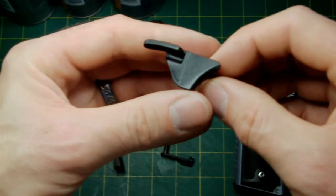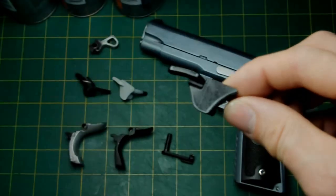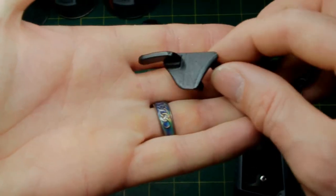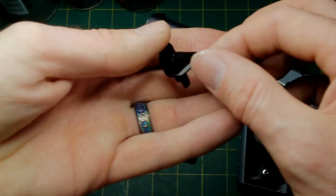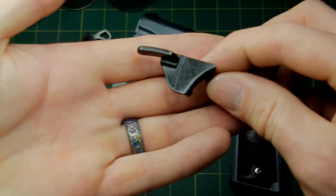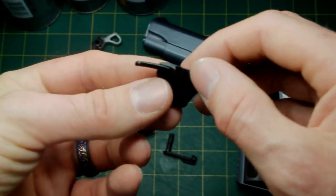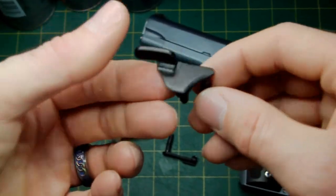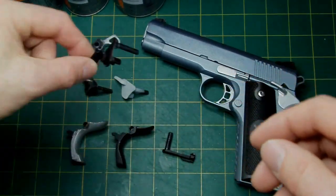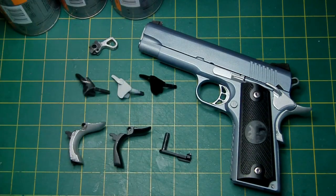And here's one I prepared earlier — this is the third stage. This is where you've sprayed it matte black, silver, or whatever colour you want, and I've then gone over it with a clear lacquer spray. It gives it a nicer finish and hopefully makes it wear a bit better — the lacquer bonds the paint to the metal more firmly. If you want it left matte, that's fair enough; matte doesn't chip so badly either. I wanted these to have a slightly glossy finish because the pistols they're going on require that — this one is from my Nighthawk T3 compensated pistol.